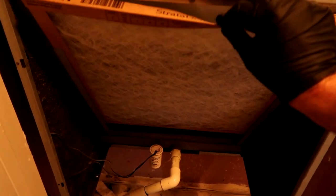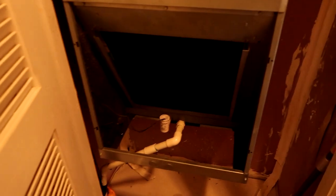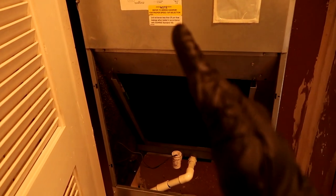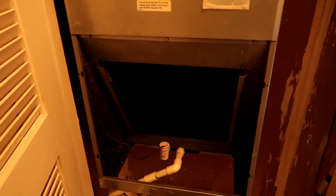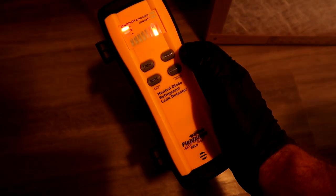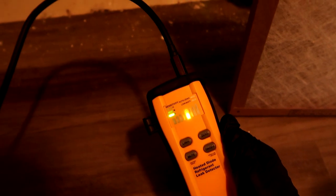Back in the apartment. Let's turn the unit off and look for the leak. I put the filter in when I do the charge because things can get wonky if you don't — you can tell when someone puts a filter in while you're down there doing the charge because you'll see the suction pressure drop. All right, grab the leak detector. These things have to warm up — once it starts giving me the beepy beep, I'll be back.